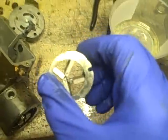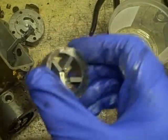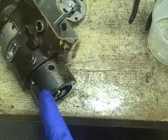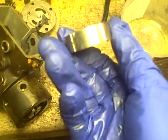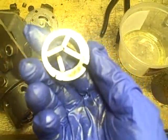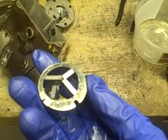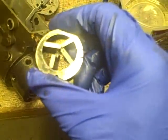This is marked with a C on this side and two Cs on this side. I'm willing to bet that C is for clockwise and CC is for counterclockwise, and depending on which way this is inserted, you can change the orientation of this pump from clockwise to counterclockwise operation. I just cleaned this up a little bit — it looked like it had rust on it but it came right off pretty easy. The fuel system maintenance was neglected on this tractor, judging from the water and rust I found when I was changing out the filters. So I wouldn't be surprised if this pump has seen some damage due to water getting in there.